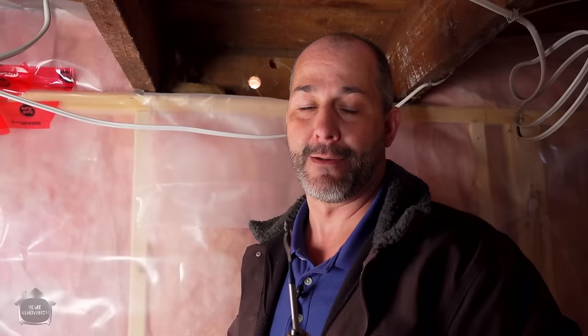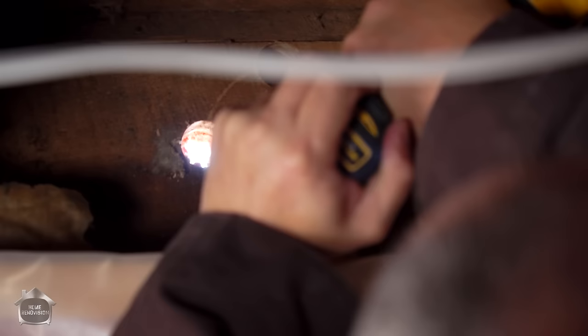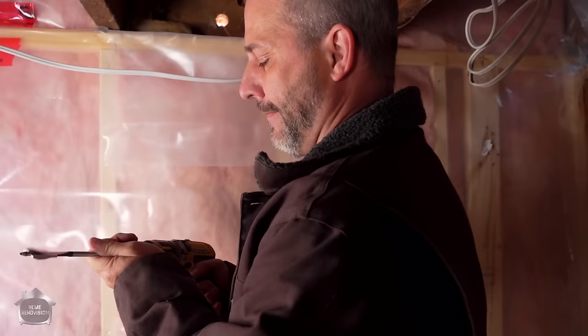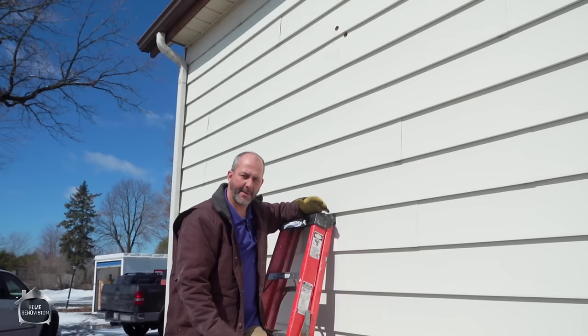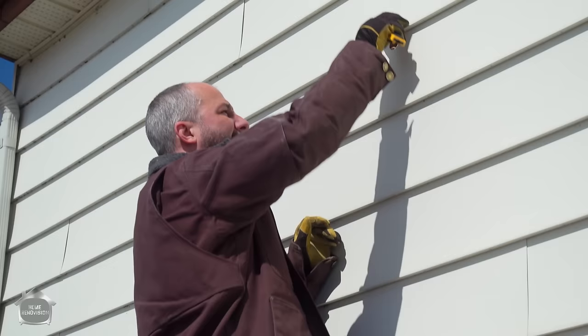More daylight — loving it. Quick tip: if you're cleaning your drill bit, take the battery out first. You don't want to hit that trigger by accident while your hands are on it. We'll extend our bit a little bit to make the hole in the top work too, since vinyl siding has a profile and sometimes you need just a little more depth to get out. When you come outside to make your hole, you're going to need a big step ladder — it is always a lot higher up here than it looks from inside. Take your utility knife and just connect the dots to cut away the vinyl siding.